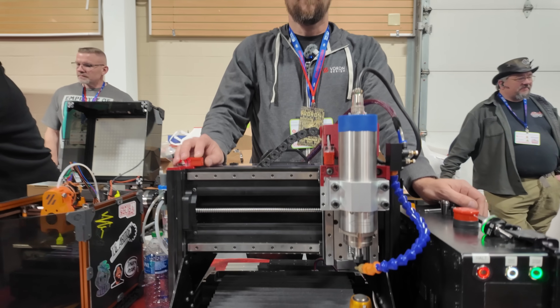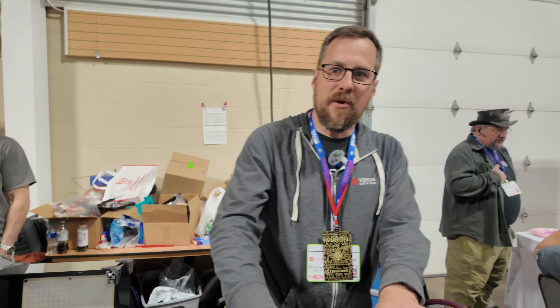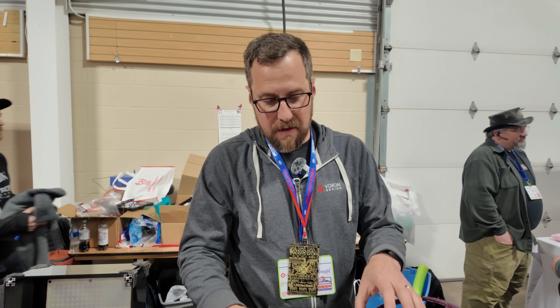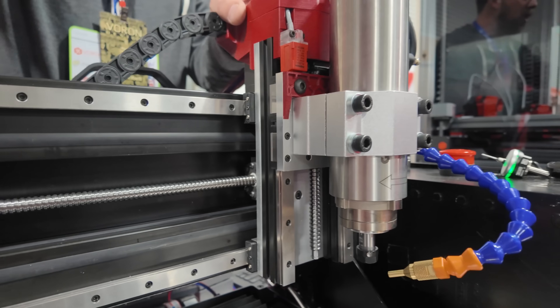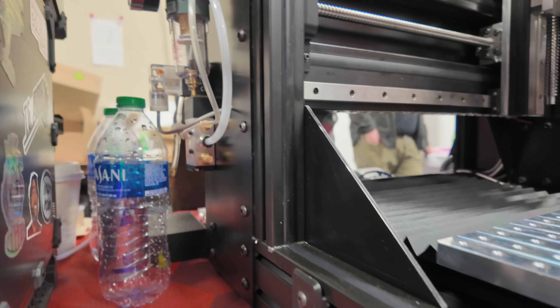The machine is pretty capable and in a nice compact package. Traditional Voron design uses completely commercial off-the-shelf parts, but here we do have machined components. There are exactly eight custom machined aluminum parts. Extrusion-based components were tested but were unable to be made to fit well or be rigid enough. However, all the custom parts can be machined right on the Cascade itself, so we're still following the RepRap philosophy of being self-replicating.